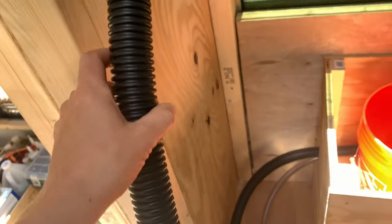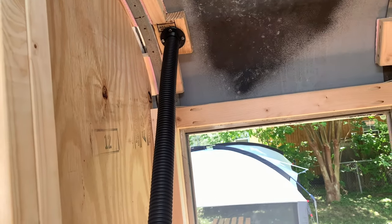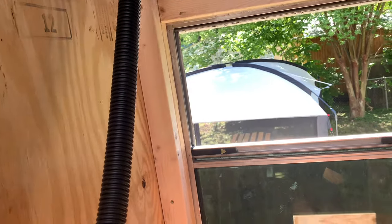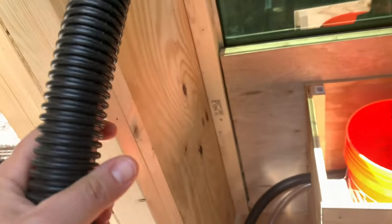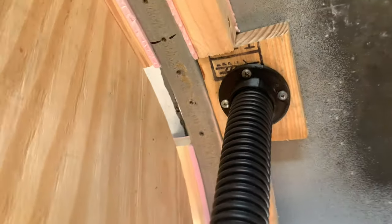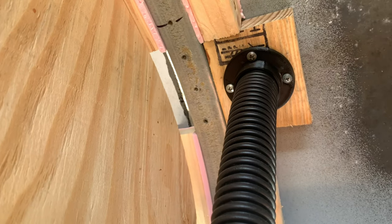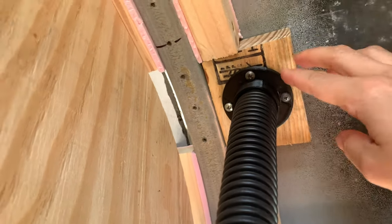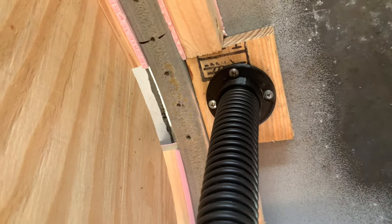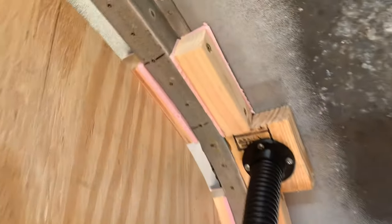This is the exhaust air vent that makes the situation less stinky. We need to trim it because we need to get the fan on there, and we just need to reduce the size in general. We wanted this to be as close to the wall as possible, so we did this on an angle and put the block there. Anyway, don't put it on an angle. The outside plastic piece on the roof cracked. It could not handle the angle. We fixed it and all is well, but we should have just gone straight up.